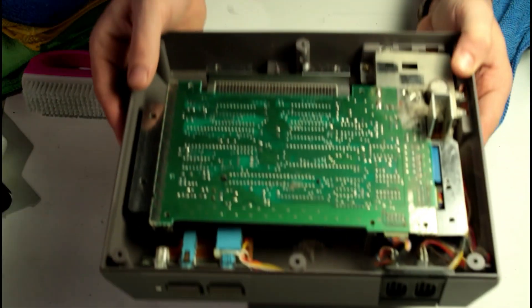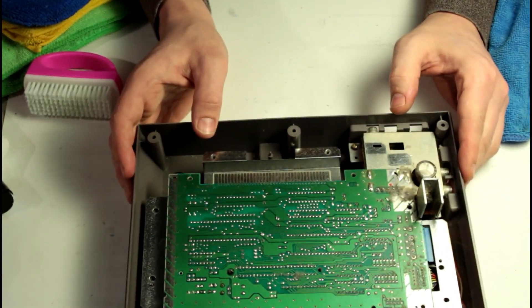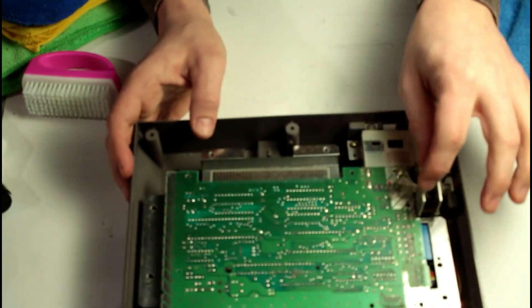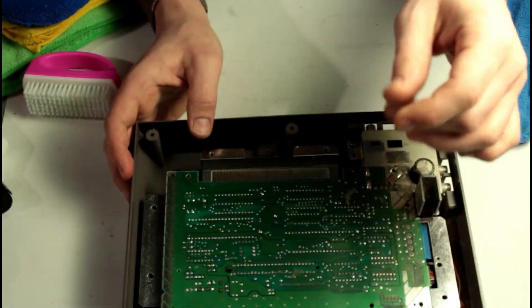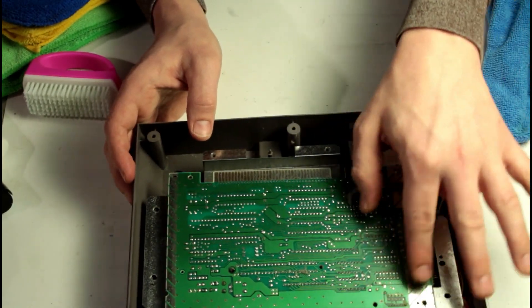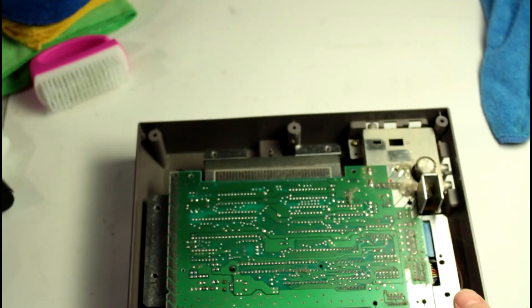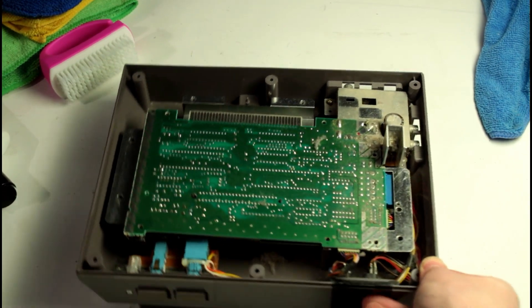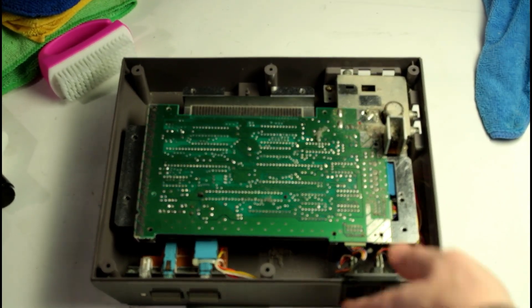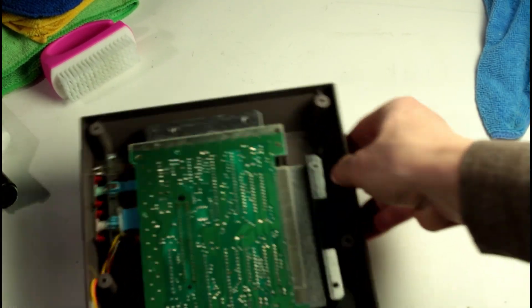Now comes time to clean this board up. I'll show you how to clean up these connections on the board — the same way essentially applies for any cart: NES cart, SNES cart, Sega Genesis cart, it really doesn't matter. Now if the circuit board's a little dirty, you can use vinegar if it's corroded, or rubbing alcohol and a very light scrub brush or a toothbrush, and you can clean the circuit board up that way — just rinse off the vinegar with rubbing alcohol if you do that. This one's a little dusty but not too bad; I'll take a little air gun to it, blow it out, and then we'll clean these teeth up.